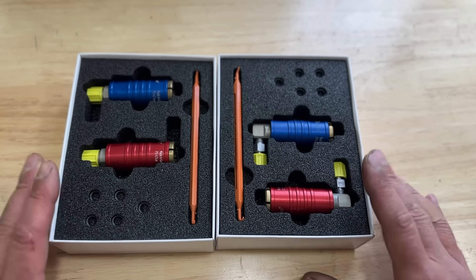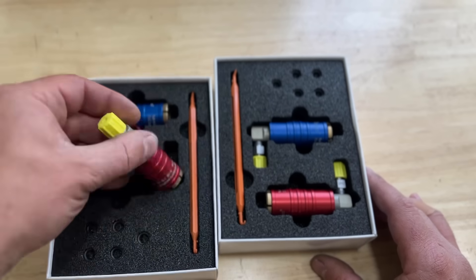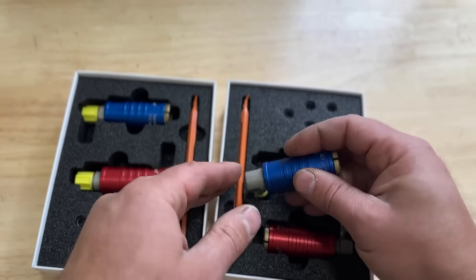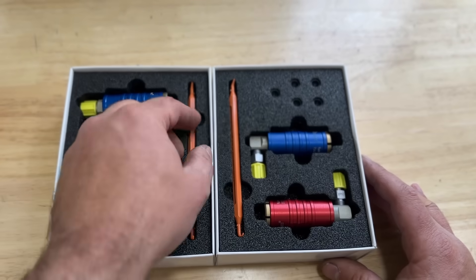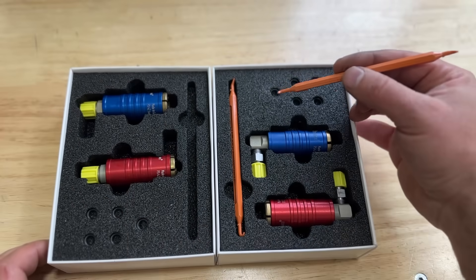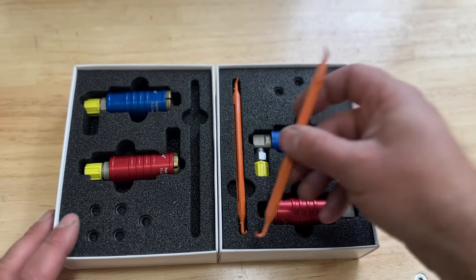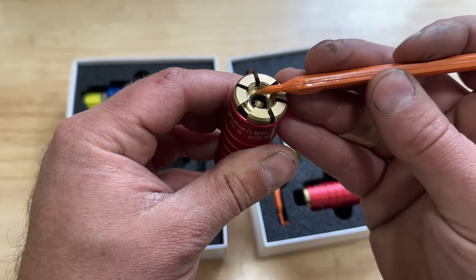Before we install these on our gauges, let me show you how these come oriented. They have a quarter-inch fitting that adapts to your hoses, and you can also get them in an optional 90-degree, which is really cool. All of these are easy to rebuild — they come with a pick so you can pull the old o-ring out, and they come with several new o-rings, because eventually the o-rings will need replacing.